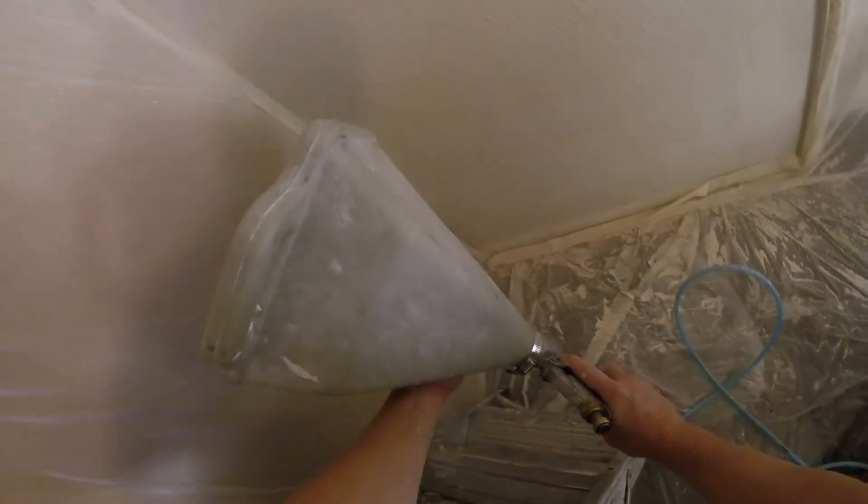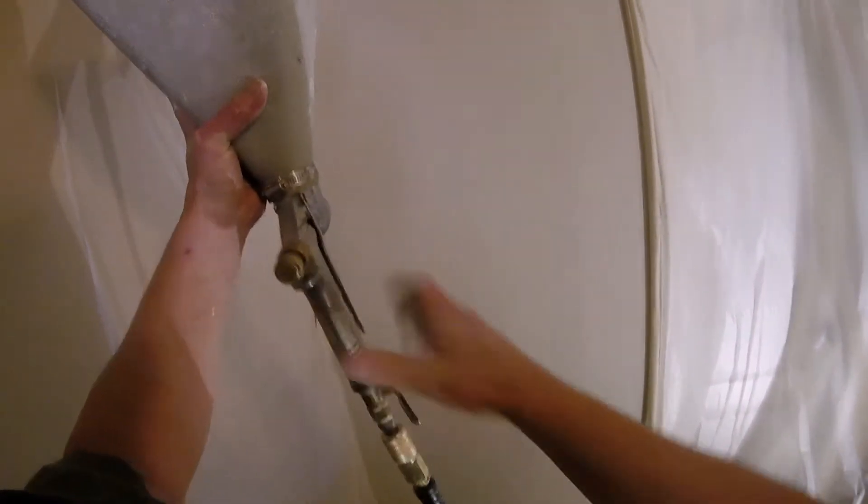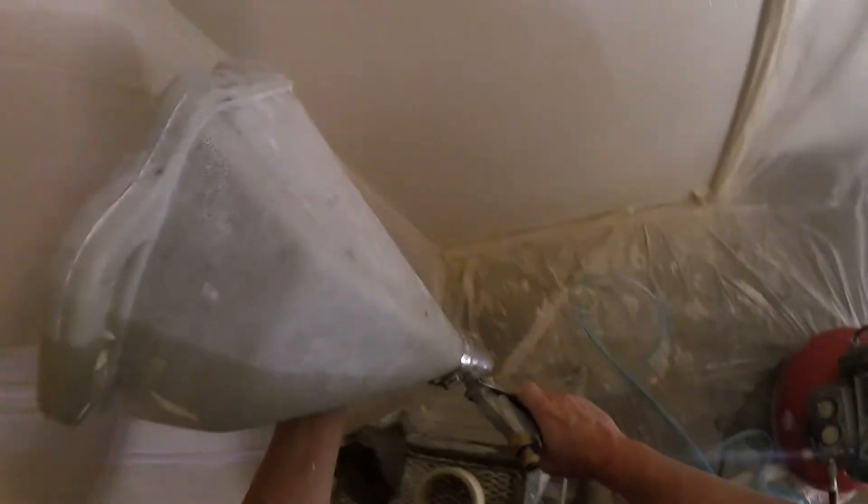This is a spray knockdown, but a spray knockdown is basically a spray splatter. We're just doing a nice, even spray splatter. If I left this texture right now, it would be a perfect spray splatter texture. Just double-check that everything looks sprayed nice and even — if we let this dry overnight and painted it, it would be a perfect wall splatter. Give extra detail around your baseboard and angles. In this room I have low lighting, so I'm using a light — always put extra lights in your work area. For a spray patch, go a foot or two above the actual patch so it fades into the existing, crossing off all your texture.